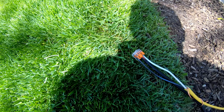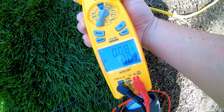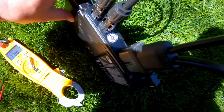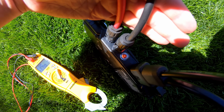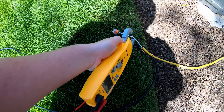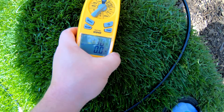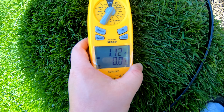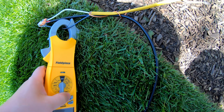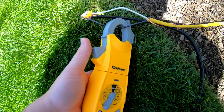I've got a little pigtail here with some WAGO connectors that will let us check the amps on this. The light continues to blink orange just because it's not connected to the gateway — however, these are designed to still output power even without the gateway. Connecting the amp clamp: 1.1 amps on the white leg and 1.17 amps on the black wire.